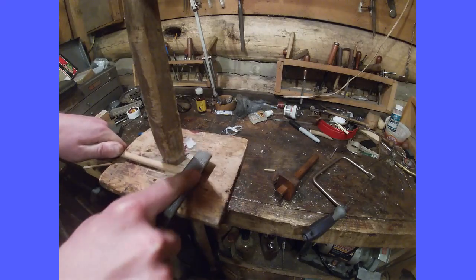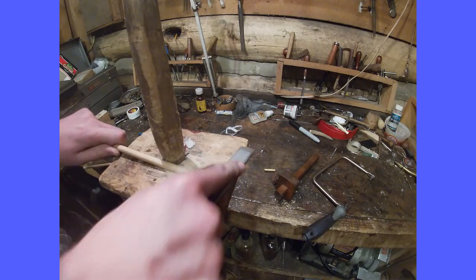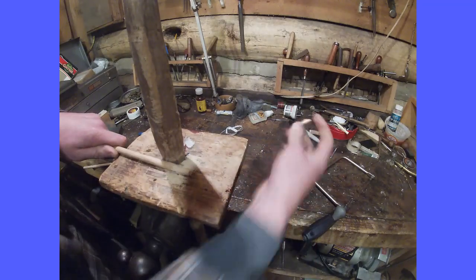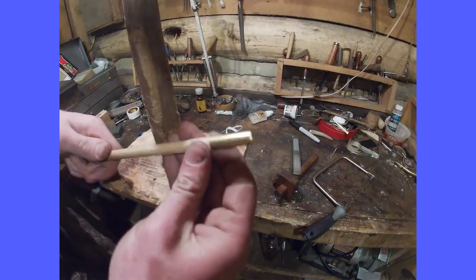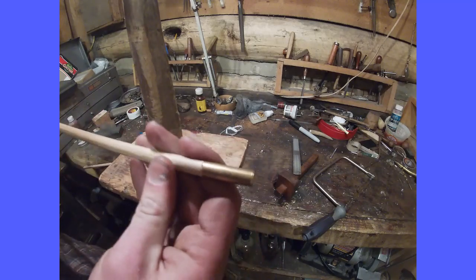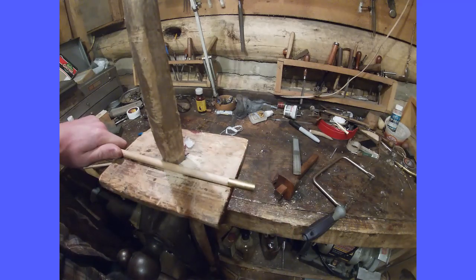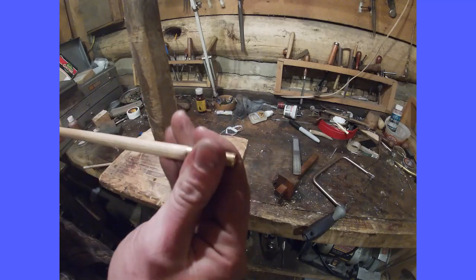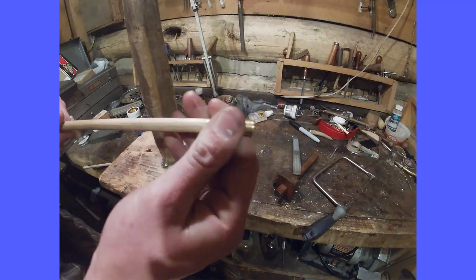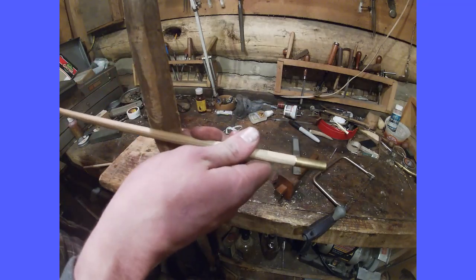That's why I cut it long. As you can see, you can file that down pretty easy and you've got your fitment. I'll now do this on the lathe to show you, if you have a lathe, what that process is. But as you can see, that looks pretty good doing it with a hacksaw and a file. So if that's all you've got, it can definitely be done.